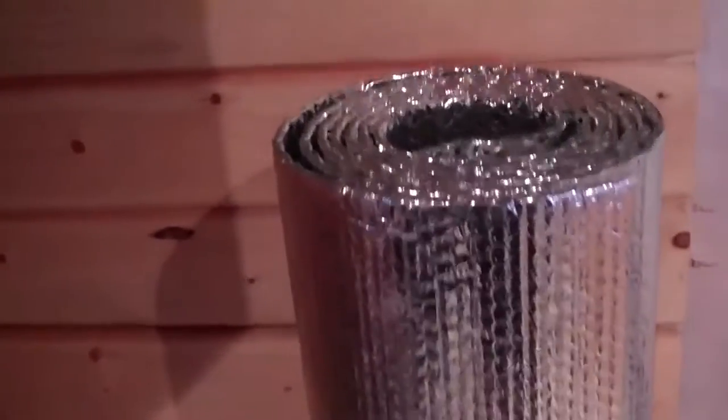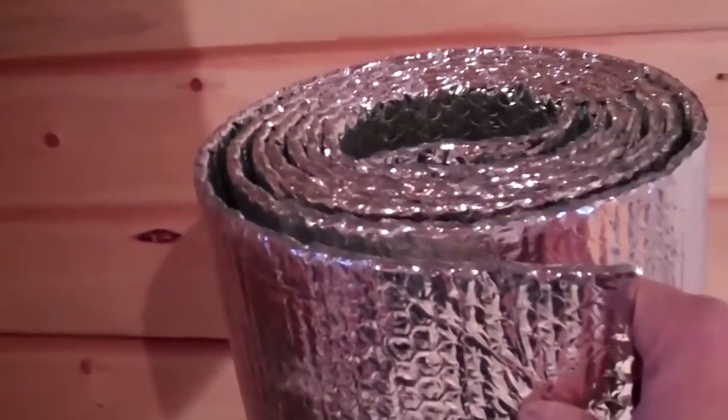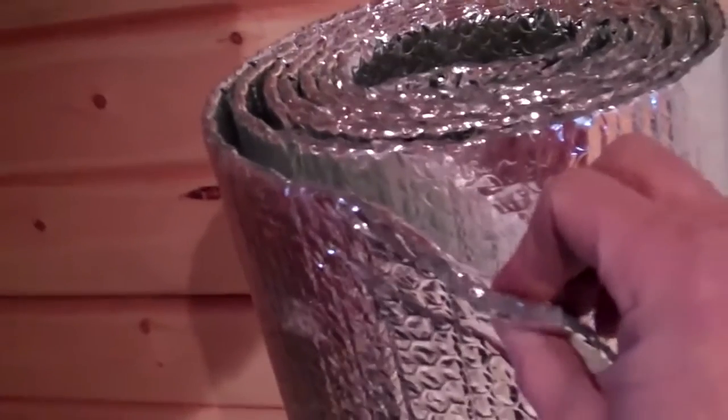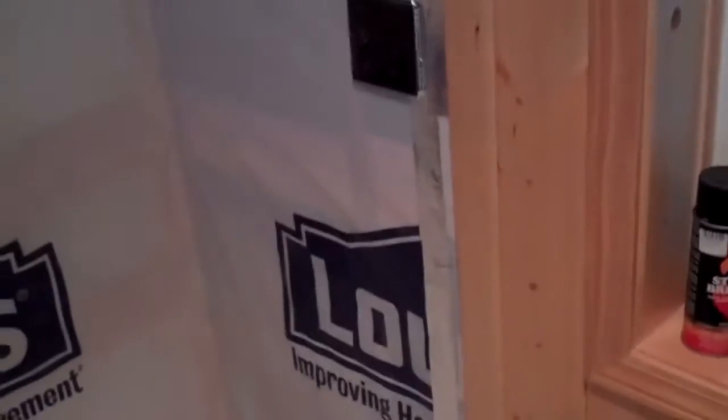The first thing we're going to do is install this product here — it's a radiant reflective insulating sheeting. It comes in four-foot-wide rolls by various lengths. This particular style is about a quarter inch thick. We're going to take this product and put it right up against the stud wall, clear to the floor. As you can see, I've already put up the heat reflective membrane — it's just stapled on there, pretty simple task, with cutouts for your outlets.